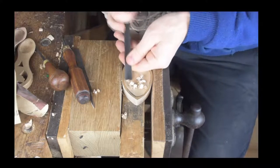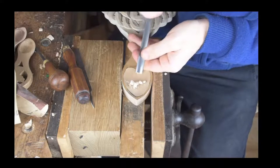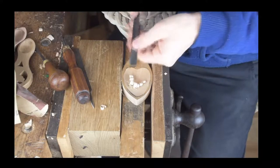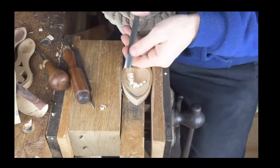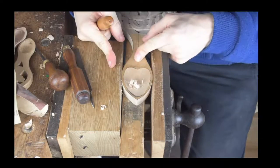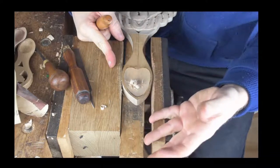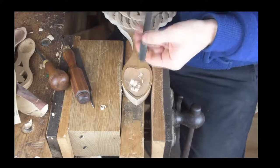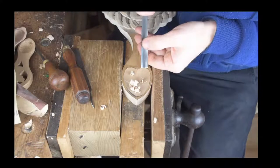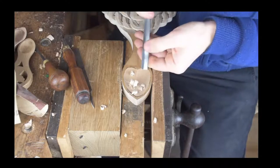When doing the bowls we use a few different methods, because we make so many spoons. To take some of the pushing off, we don't always carve them by hand entirely — to start them off we use a router and a template quite often just to get that basic work done. But afterwards we still use the hand gouges to finish them off and then we sand them as well.